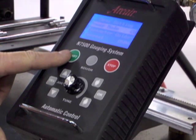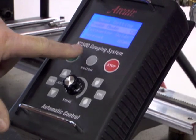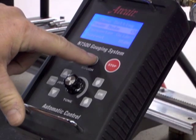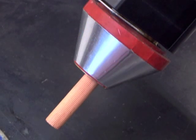Start button. Stop button. Press the start button to begin gouging. Press the stop button and gouging stops. This is the rough machining button. Press this button to stall the electrode while maintaining current to the torch head. Release and the electrode begins feeding.